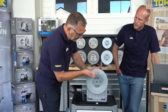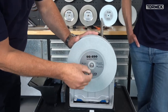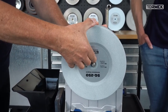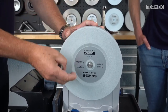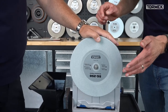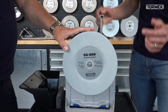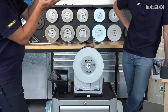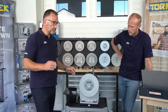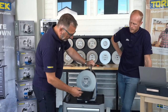To prevent the up-and-down movement from shifting: this distance here is two tenths of a millimeter longer when you mount the stone in the worst case, so you start to grind unevenly and get wobbling. You can avoid it - it's very little but to summarize: always when you start truing or set the stone, put it with the text exactly horizontal. Then the two tenths of a millimeter off-center is always in the same spot and it stays perfectly round.